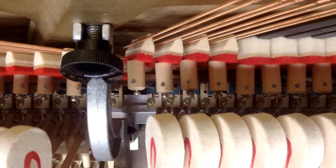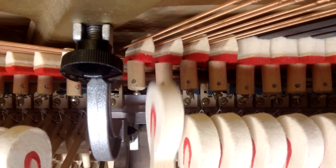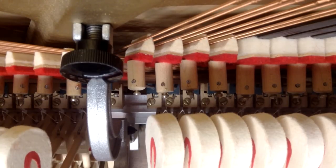There are other things you can do to change the touch weight or feel of the action to be heavier or lighter, but as you're adjusting these damper spoons the basic premise is to do it at about halfway — and that's where we're at right here. As we go into the next part of the video we'll show you how to make that adjustment.